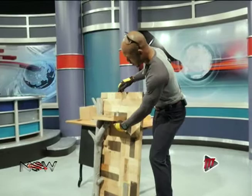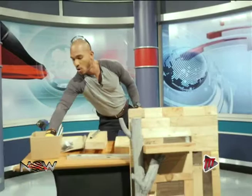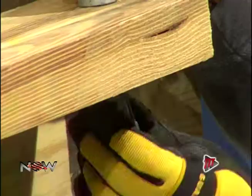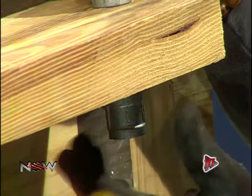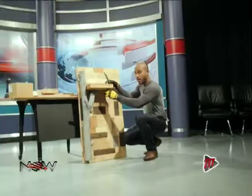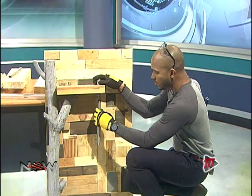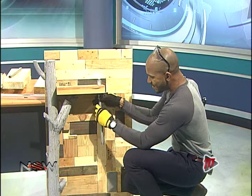Here, because we have a stop on one end, we also need a stop on the other end. So we're gonna grab another collar, and I'm gonna grab one of the lengths here right now. This is a 12-inch length. Now, you could change this however you want with whatever is comfortable for you. I'm using a 12-inch length just because I want that spacing for this first part of the shelf. So I'm gonna attach a collar underneath. And what this collar does, once I get it tight, and when I use both pipe clamps, it's going to keep this thing firmly in place and won't move at all. But for now, I will add the other piece here, which is the 12-inch length.